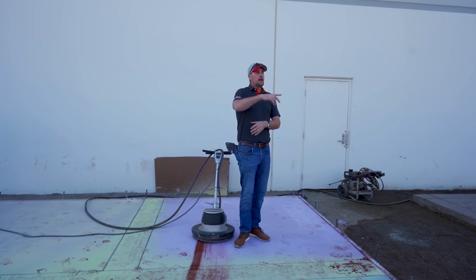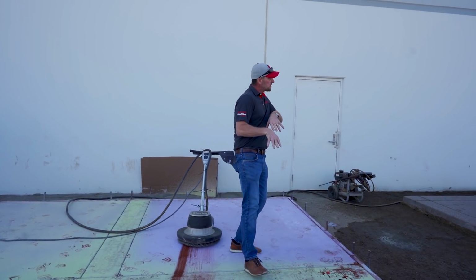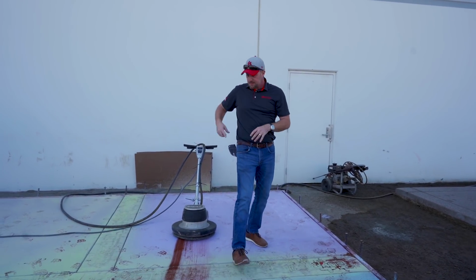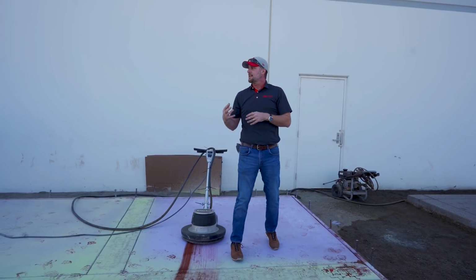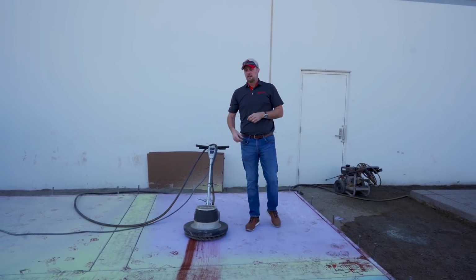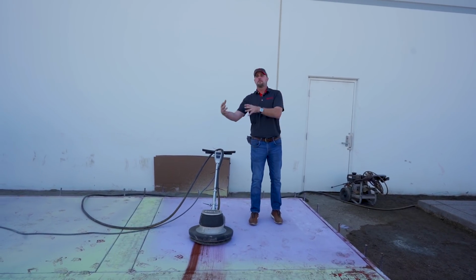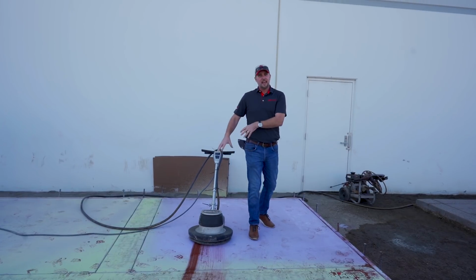This, I can have any of you guys come up and run this and you're going to get the same finish. With a power washer, you're only cleaning from this side, or maybe this side. This is spinning all the way around. You've got brushes, so you're going to clean that aggregate. The reveal in the sand is going to be much clearer, cleaner, and it's 5 times quicker. I was covering 5 times the area than my guys running with a pressure washer, so this gave me production.